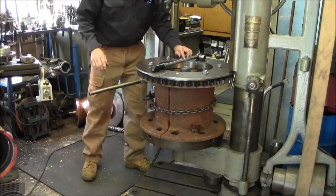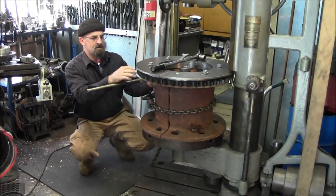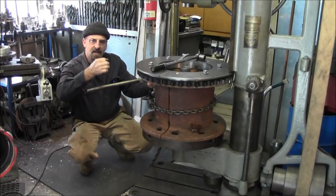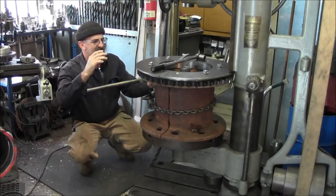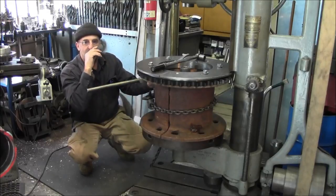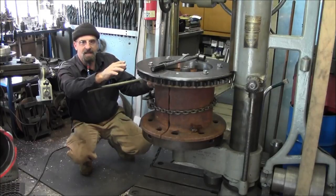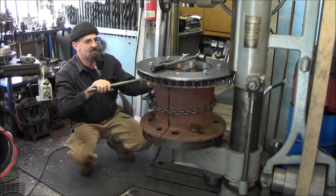All right. What we're going to do here is we're going to go ahead and break this down now so that we can set up the individual halves one at a time in here and come down in and locate that hole. And we're going to open that hole up to about 1 1/4 inches. That'll take care of the countersink that's on this side here, so that we have a straight through hole. And then we're going to take a piece of material in the lathe there, and we're going to turn out little standoffs, and we're going to have 8 of them.